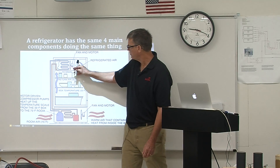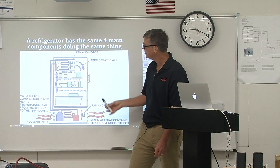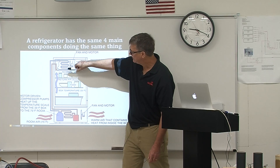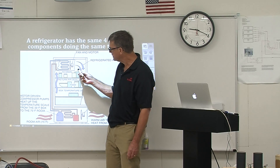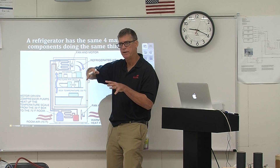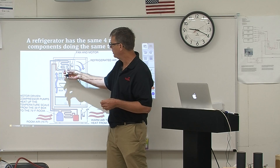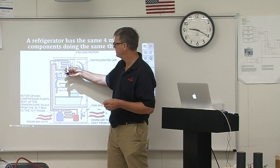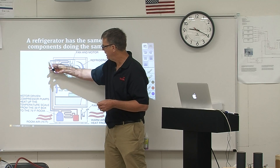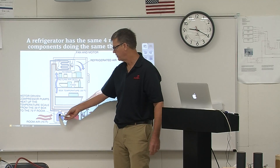The first thing we're going to do is cool the freezer section down to about five degrees. We take that cool air and share it with the refrigerator space itself — this is done by cycling your fan, and all new refrigerators may have a damper section. We are taking that evaporator, flashing gas, and absorbing heat from the freezer section, then coming back to the compressor as a low-pressure superheated gas and starting the whole cycle again.